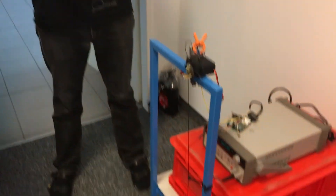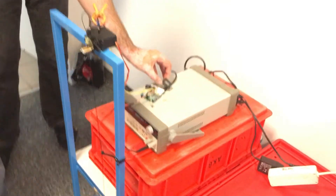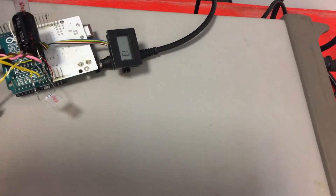The Arduino is doing two things: it controls the servo motor and checks the cable for continuity — specifically resistance. If the cable's resistance exceeds 10 ohms, the Arduino stops the test, which is defined as the cable being broken. Every cycle, the Arduino sends a 5-volt, 50-microsecond pulse to a counter device, which counts up to track the total number of cycles completed.